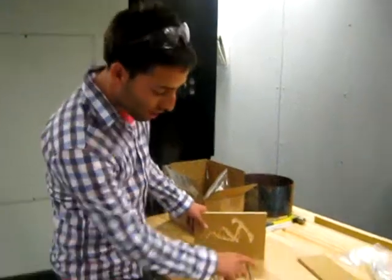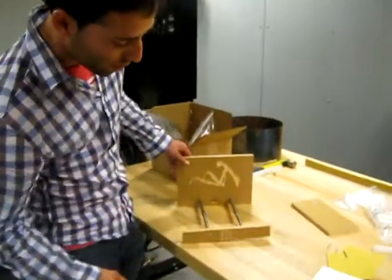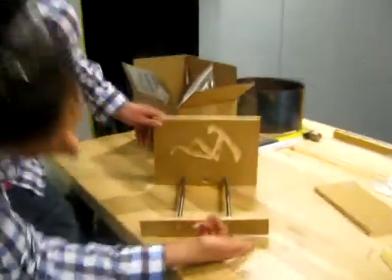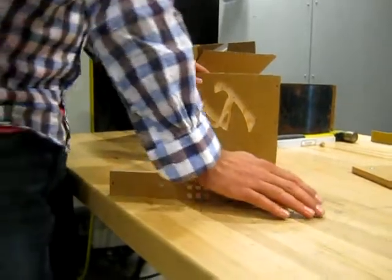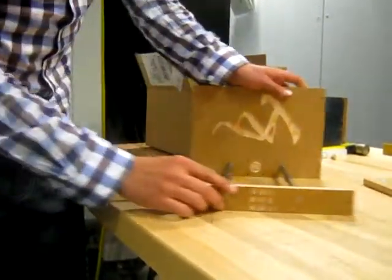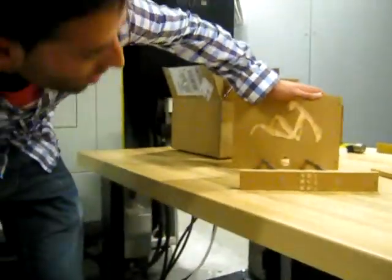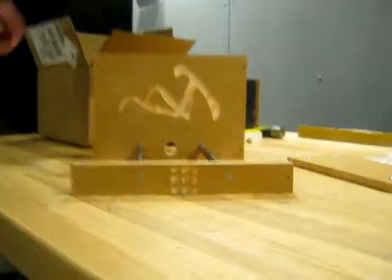Okay, so once you've put the front plate onto the rods, you just want to check, make sure there's no twist. You can see right here, there's a little bit of a twist in how they're lined up. So you're going to try and correct for that. Just put a bit of weight on it. Hysteresis. You want to make sure that you allow for any springing back in the rods. You can see there that it sits quite flush with the desk.